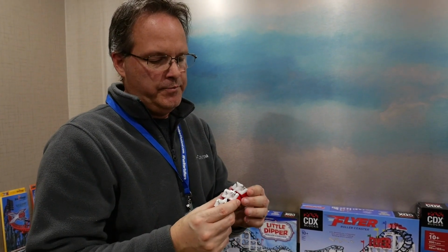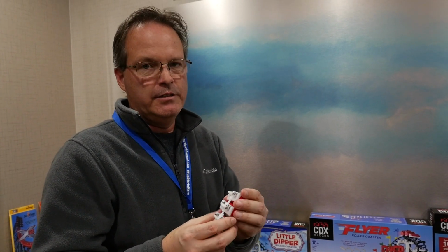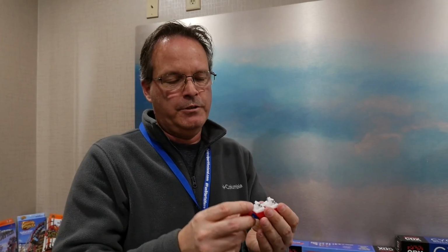And then you have, of course, a metal wheel with a Delrin plastic, which is self-lubricating plastic chassis. And that's how you get the efficiency, which is what you were talking about, not wanting to do metal on metal. It's best to do metal on plastic. Like with gears, you alternate metal, plastic to get the best efficiency. So we've tried brass and stainless steel and really don't see a difference.